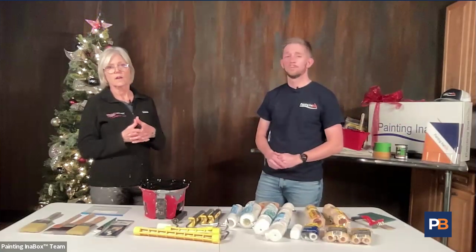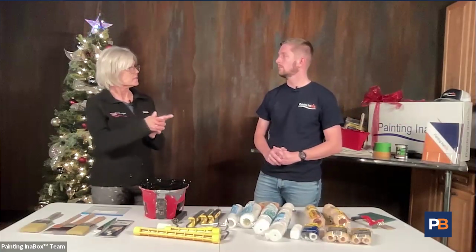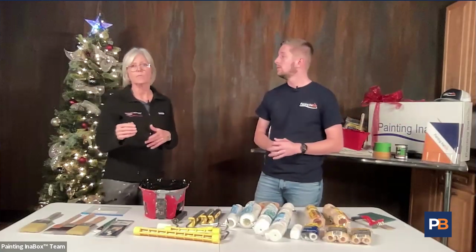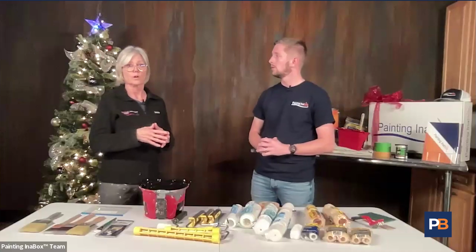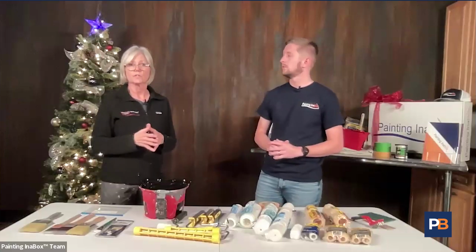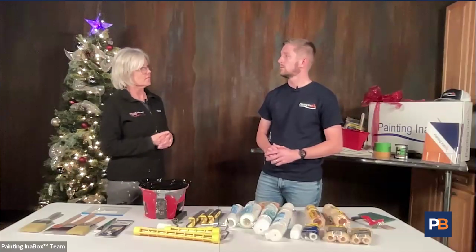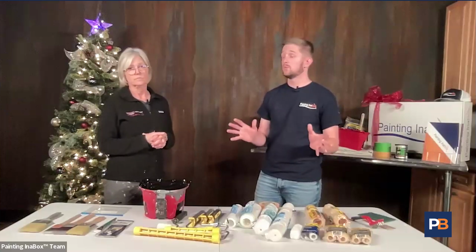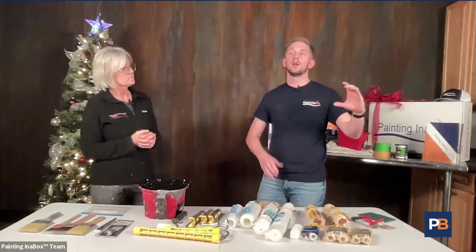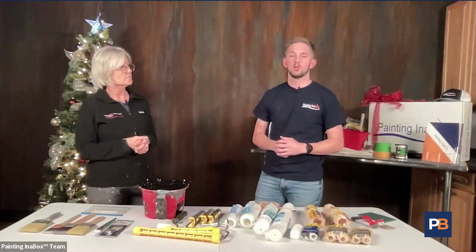Well, and a lot of the paint companies do. Is that information in our guide? Yep. They will recommend a certain roller, a roller type, a roller nap, and the best brush, for instance, which we'll go through, and that's helpful. Sherwin-Williams is so far the best company we've seen in that way. You can select the paint you want, and they'll tell you this is the brush to use, this is the roller to use, depending on what finish you're looking for.